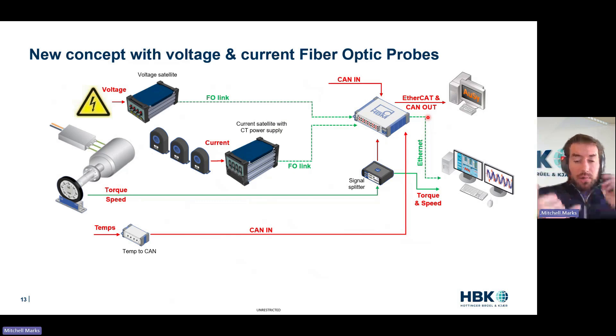What's our proposed solution? How do we solve this issue — how do we help you with that EMC, with that safety? We have a fiber optic probe that we're releasing early next year. It's very exciting. It's a small box that will make either four high voltage measurements right next to your inverter, digitize it right next to your inverter, and send it back through fiber optic — over light. Light doesn't pick up EMC. Light doesn't pick up EMI. Light doesn't give a high voltage safety issue. We have digitization right next to the measurement — safely, noise-free — back to the measurement unit.